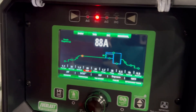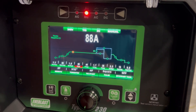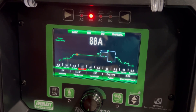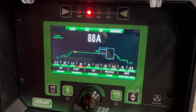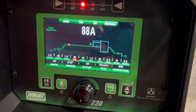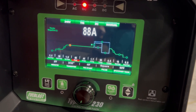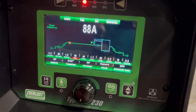Down-slope takes half a second down to 10 amps on the back side, and post-flow of 8.8 seconds. So if I'm welding something thin like this 0.065 stainless tube, 88 amps gives me enough power to get full penetration. And I've got a range where if I'm starting to blow through or have a little too much heat in the part, I can back out of it. Even with the finger control — most people use a pedal — I've got great control. When I go to weld something thicker I'll crank up to about 105 to 125 amps depending on material thickness. 105 is my standard go-to for a V-band or a regular exhaust hanger.